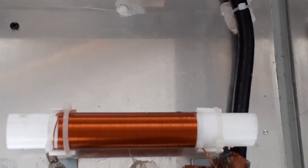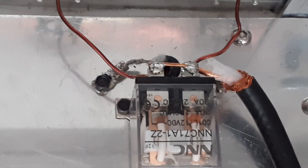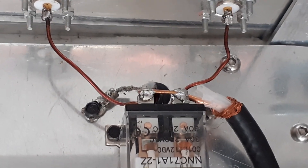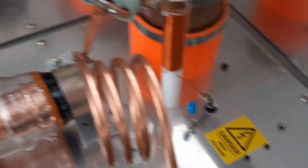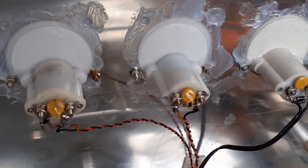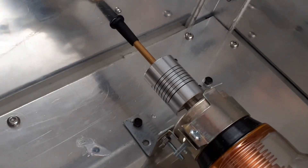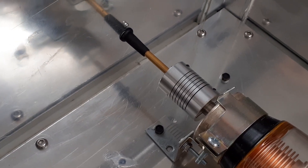That goes off to Westflex 103 heavy duty coax after this relay, which I got from China — 12 volt, 30 amps, seems to work quite well. I'll show you the rear of the front panel — not very glamorous. Left to right: high voltage and grid current meter in the middle, and the plate current meter to the right-hand side. There are wires going underneath the meters and couplers for the capacitors.